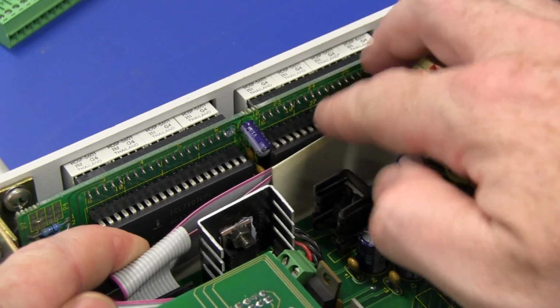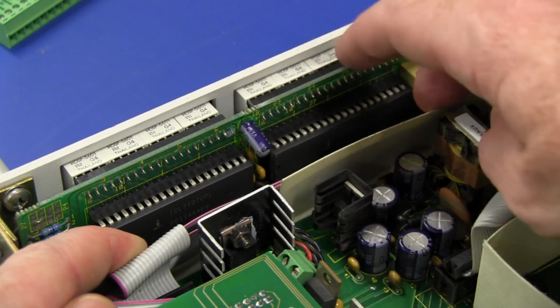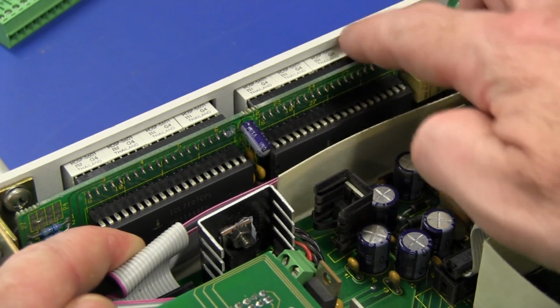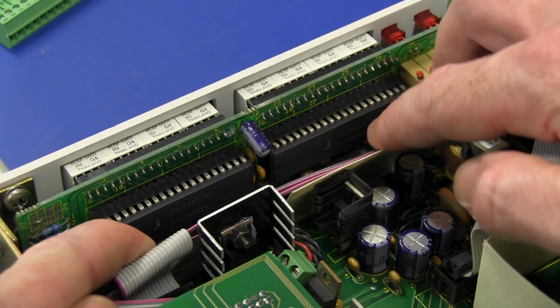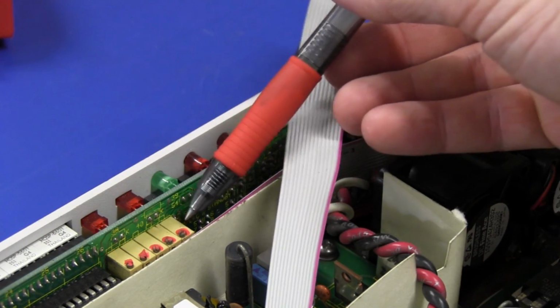And there's nothing to write home about on the front panel here. Pretty basic 7-segment LED display interface with the sockets, just putting them out a set distance. Basic standoff construction with the big 40-pin DIP. No surprises. ICL7107. And we have some calibration adjustment pots here.